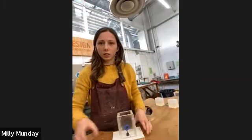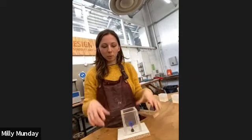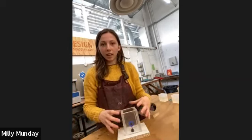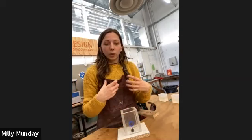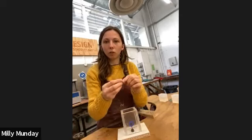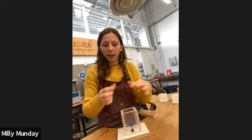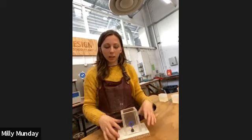No? Okay. So I just want to briefly talk about the cold mold. A cold silicone mold, again, is all about the mold frame, really. And in industry, you get cold mold frames already made, like this perspex frame, and these frames have a funnel within them, and it's the correct size already. And all you need to do is pour silicone in.